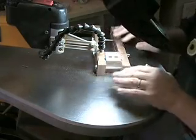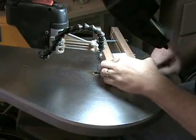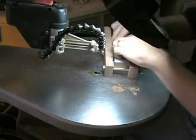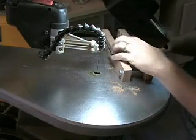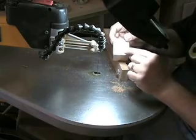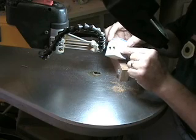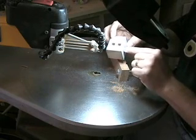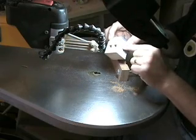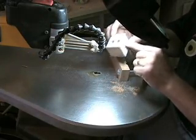Alright, now we're getting started to roll this thing over, so we undo the jig. Turn it over. Now when we cut this other side here, these holes are going to create an area that is much thinner that the blade is cutting through. So we're going to go through an area, and then all of a sudden the blade is going to speed up in the feed rate. We have to be very careful there because we could easily blow through the pattern and ruin the piece.